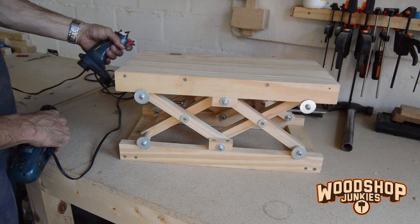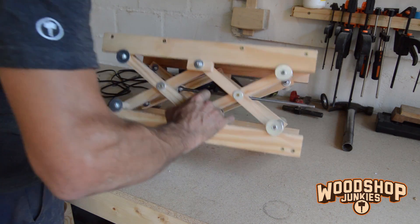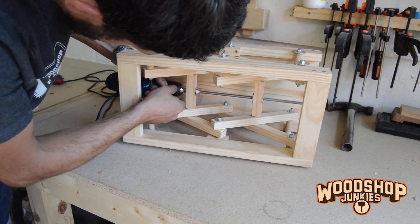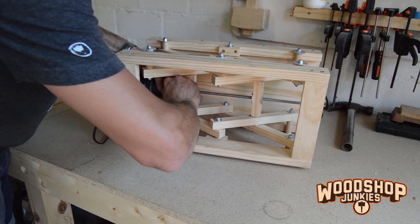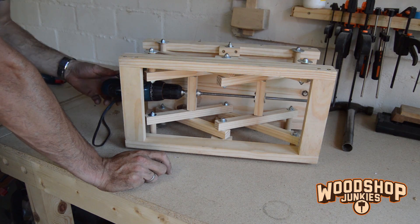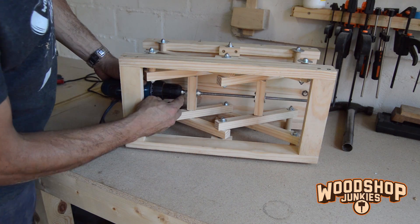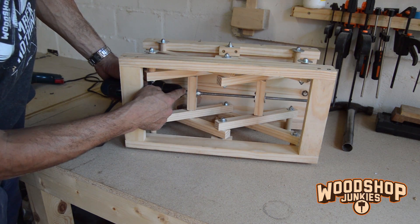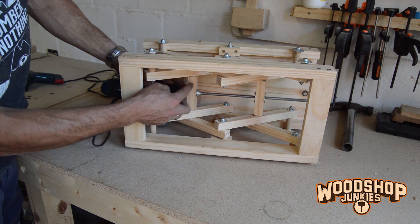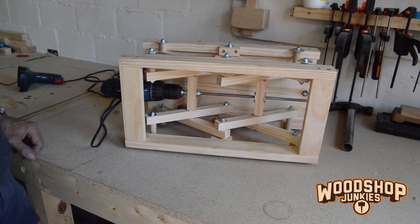So now I've got my motor and my trigger to operate it. All I want to do now is attach the motor and fit the torque arm. Irrespective of what motor you use, you would attach it with some sort of coupling on this rod here, then fit a torque arm to the cross brace so the motor is stable. That's what I'm going to do now and then we can test.